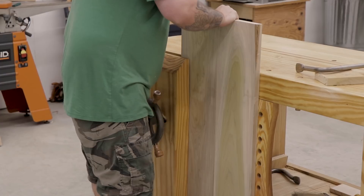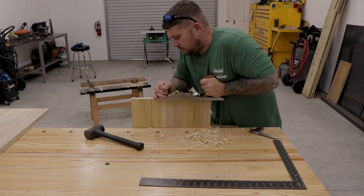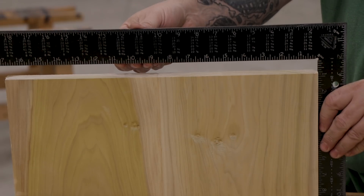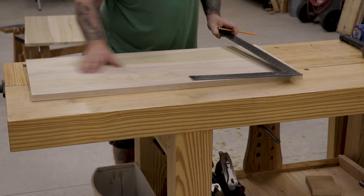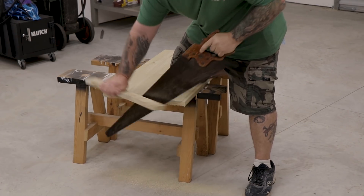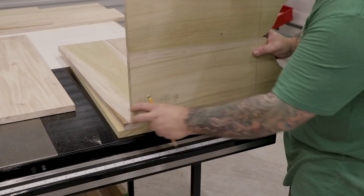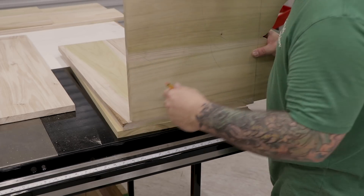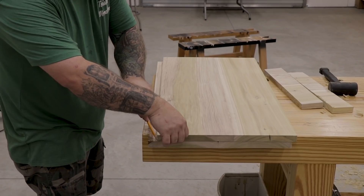Next I'm going to start making the boards that will become the sides of the chest. The process for squaring these up and cutting them to length and width is pretty much the same as the end boards, so I'll give the abbreviated version. I'll clamp the board in my workbench and use my low angle jack plane to square up one end, measure out the lengths, use a framing square to draw a line, then take the boards to the saw benches and cut them to length. Back at the workbench I'll clean up the saw marks and make sure the ends are square. Next I'll use the end boards as a reference to figure out how wide to make the sides, mark off where I need to make the cut, and draw a line between the two marks.